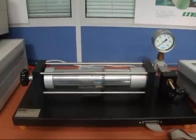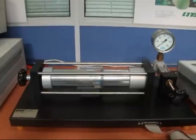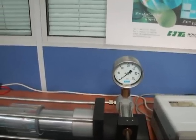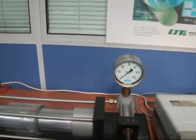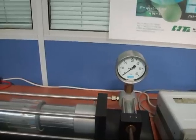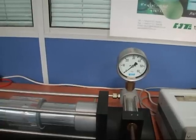This is the experiment for a thin walled circular cylinder under internal pressure. This is the pressure gauge, measured in increments of bar, where 10 bar equals 1 MPa, or 1 bar equals 14.5 pounds per square inch. These are the two electrical resistance strain gauges used to measure strain. The longitudinal gauge is gauge 1 and the circumferential gauge is gauge 5.